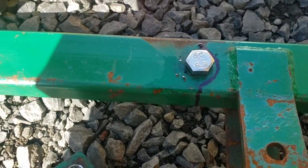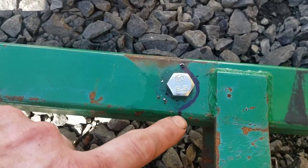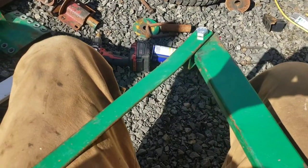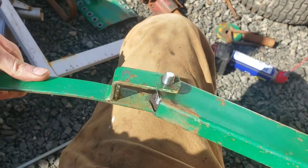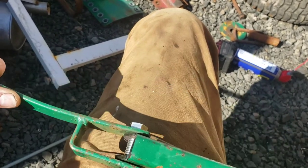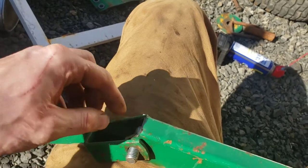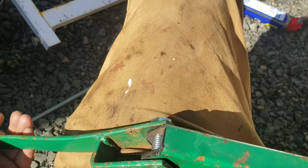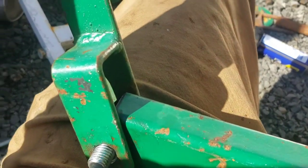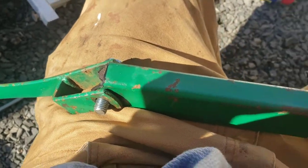I got that hole step-bit out. Don't forget to lubricate when you're drilling — makes your bits last a lot longer. I also marked where I'm gonna cut it out with a Sharpie. That's what I've come up with so far — got that in there. Cutting off the end. It's not smooth yet, still kind of jaggy, not perfect, not painted — I know — I'm just going for function right now. The next step is to put another bolt somewhere right about here with just enough space to fit our rod through, and then there'll be a die on the back side of it to push it around.